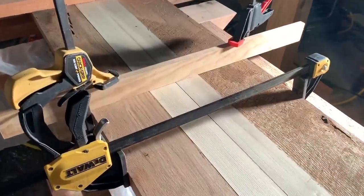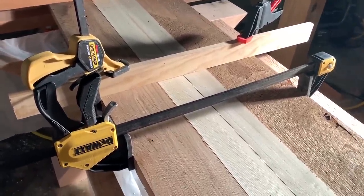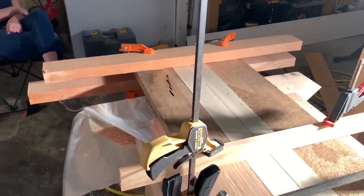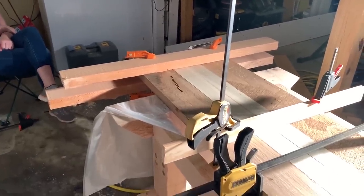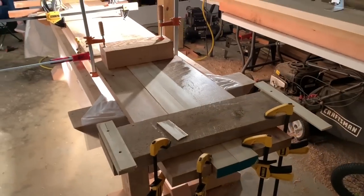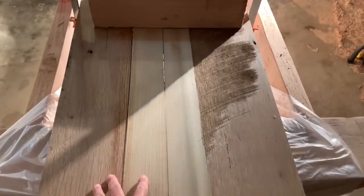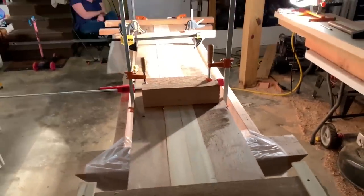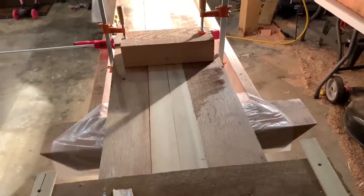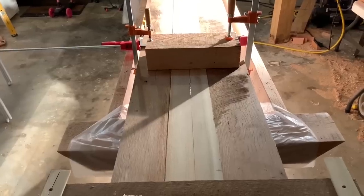Same thing there with a piece of 1x4, and turned it up end ways so it was stronger, and some 2x4 Douglas Fir that's going to be on the end of the table. I'm actually using that as well down there. So you see, it's all hands on deck for every single clamp I have. But the goal is to get these things all married, glued together, which we're going to let set overnight. I'll flip it over tomorrow and put all of the pocket hole screws in, to give it a little reinforcement.